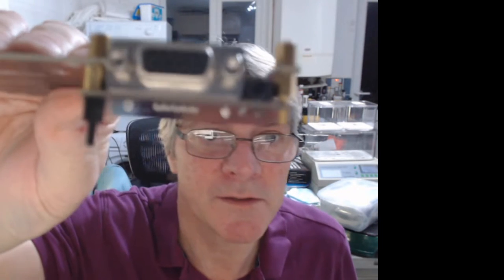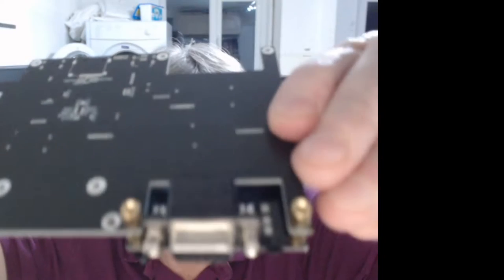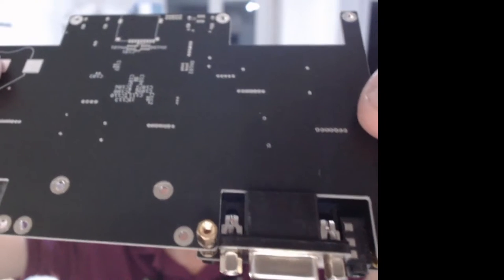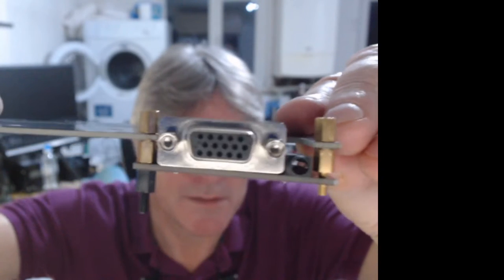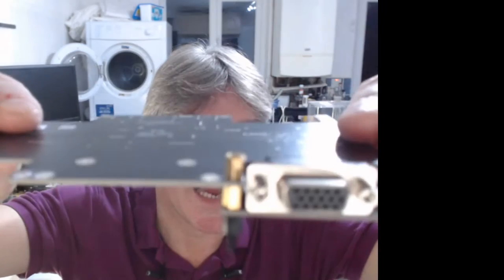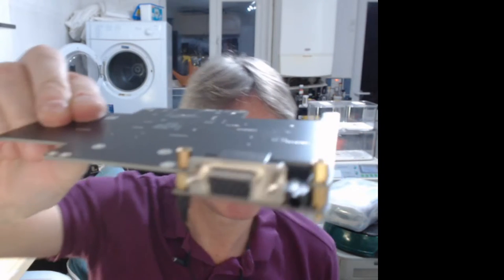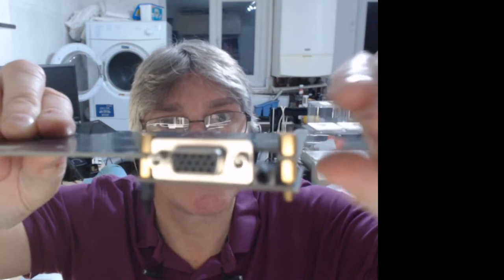Okay. So what you see is this. If we look at it from the underside of the board, can you see how the connectors come through on the underside? That's what the cutout's for. So if you've got components that are taller than the height between where the top of the tile is and where the logic deck is, which is 7mm effectively, you can cater for taller things. I know this is upside down, but just to stop it falling out, that's the point of having those cutouts. And this fits nicely in this case.